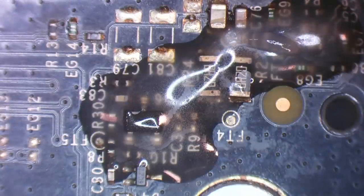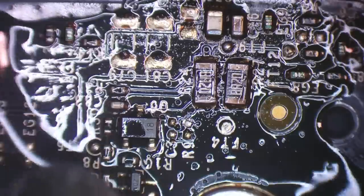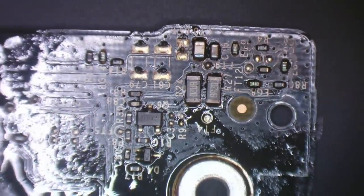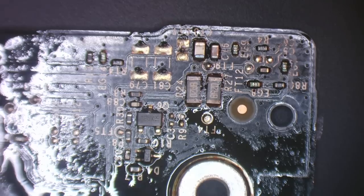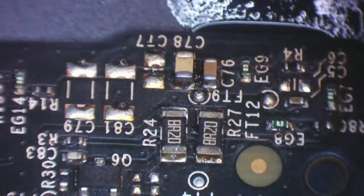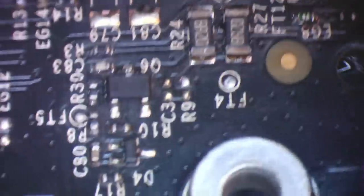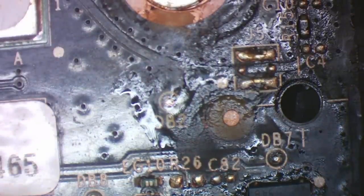I'll put a nozzle on my hot air. I think all of that's had probably enough reflowing — pretty much the entire circuit. Let's just let it cool for a second and then I'll clean the flux off. Honestly I think there might be a little bit too much liquid damage on this to fix all of that with a reflow. I could use it as a test board and put one in that's fully working. I don't mind doing that — use this as test only. It doesn't look that bad though, but I still wouldn't be comfortable letting it go because there's a good chance it might fail in the future.